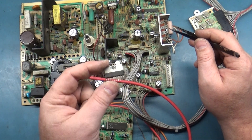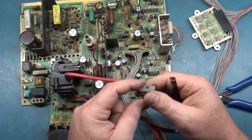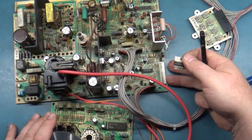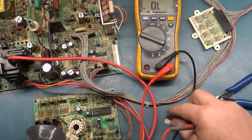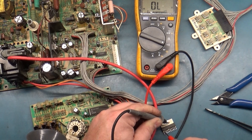It just goes to show that even though it doesn't read shorted, it can still be bad. I went through pin by pin — pin one to ground, pin two to ground, pin three to ground, and so on. Everything on this read exactly the same as my test chassis. No anomalous readings, no pins shorted to ground that shouldn't be. Pin five was in fact correct. On the counterfeit ICs, pin six goes to ground. On the real ones, pin five goes to ground. So you'll notice here: one, two, three, four, five — that's correct — six, seven, eight, nine, ten. No pins shorted to ground, no anomalous readings, but somehow it was still unable to provide deflection.